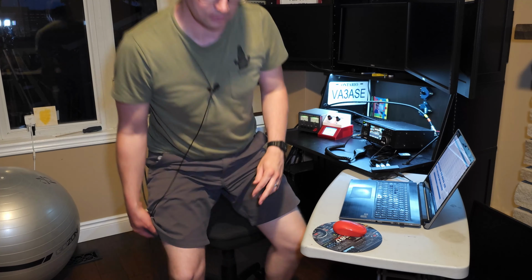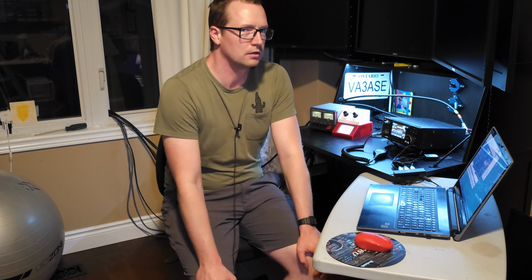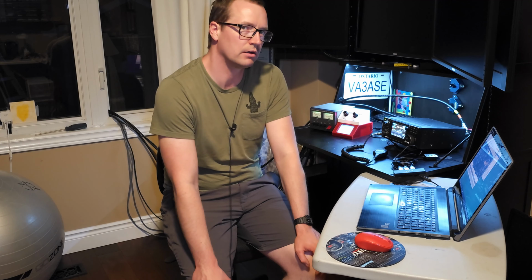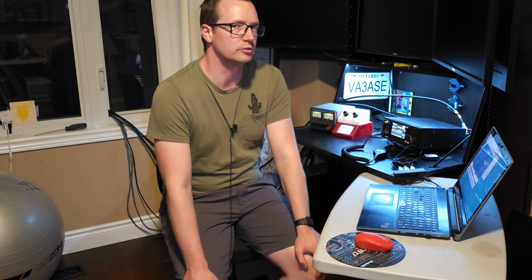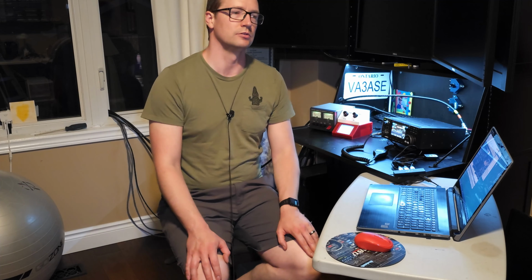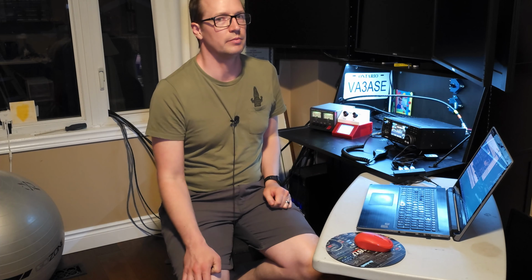Okay, that was unsuccessful, but also successful. What was successful there, even though I did not make a contact, was that I put my call out and I could hear myself coming down on the downlink. And that's why we need a full duplex radio, like the 9700 here, because they have the full duplex capability, meaning you can listen on one band while you transmit on another band.